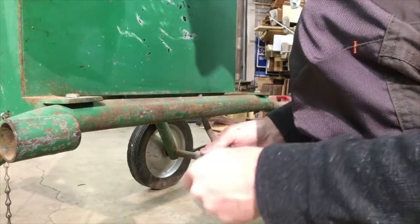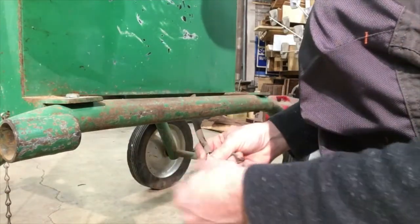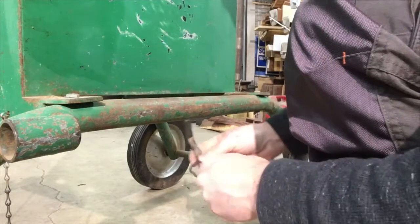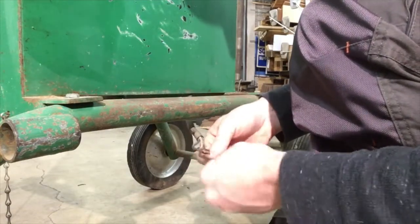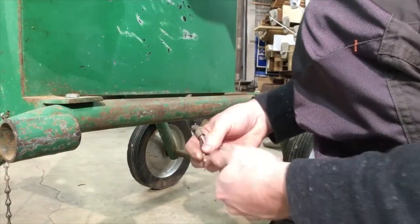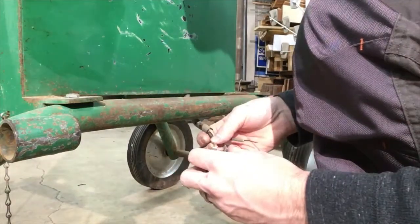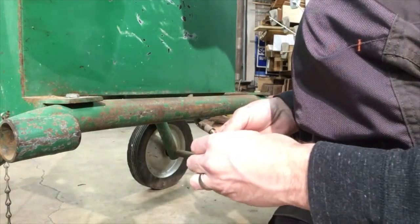This part really couldn't be easier. This is the wire I took off the old switch. We've got the two wires that need to go across the switch, and then a ground wire. The ground wire probably isn't too important since the wire is just going to the motor, which is attached directly to the body. But since I've got it here, I might as well put a lug on it that I can attach to the back of the body of the switch. These two wires, even though they're black and white, it really doesn't matter — they're just basically the broken hot wire. These are screw terminals but they've already been soldered to, so rather than find screws I'm just going to solder these.